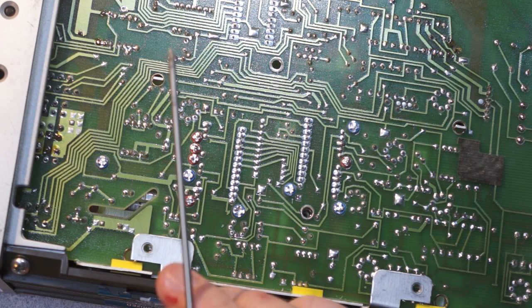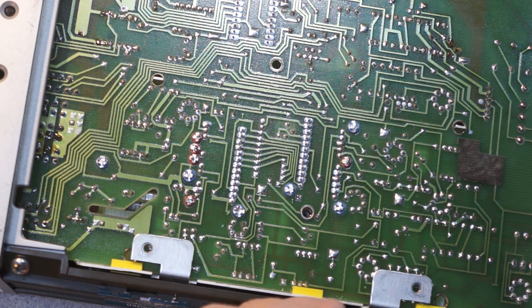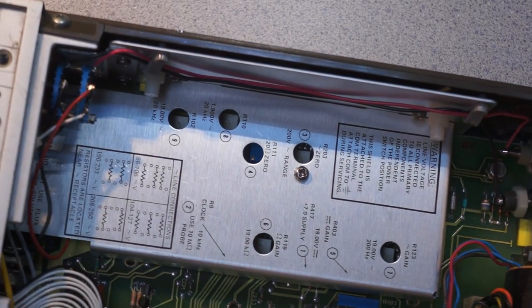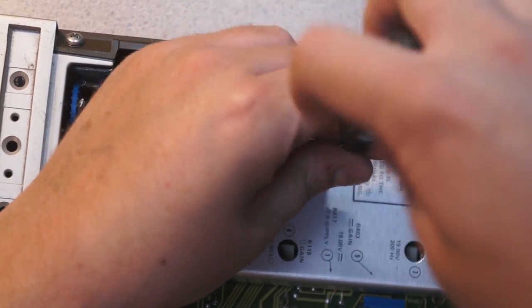There are some interesting application notes I've read, when you're dealing with some of the modern op amps with picoamp input leakage current, where they discuss ultra, ultra high impedance, gigaohm layout techniques, and how a lot of it actually has to be done by hand, just because there are no machines that'll do it. That stuff's quite interesting to read, and if you want to take a look at it, bother me in the comments and I'll post links to it. So I think what I'll do now, because this is looking quite interesting.